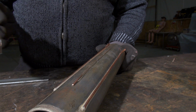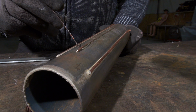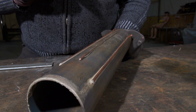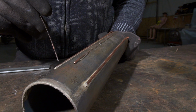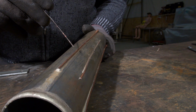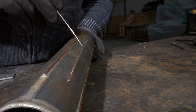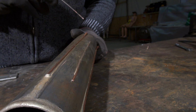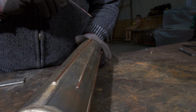Now in the middle here, we have something different. This is a solid 2 millimeter copper wire, and we used a different method for soldering this one. While these two contained an entire length of silver solder material, this one used silver soldering paste. That's simply a paste that is put underneath whatever you want to solder, and then this paste decomposes into a mixture of flux and the silver solder material itself.